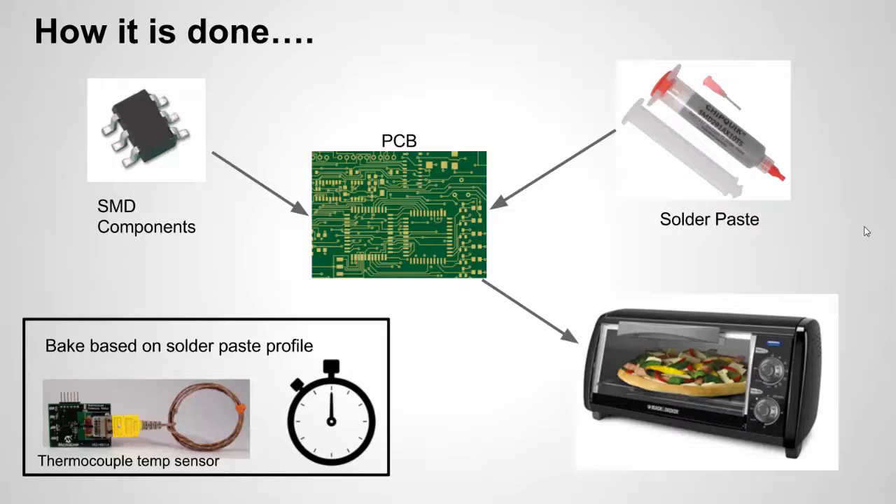There's going to be a profile we need for the heating. They make reflow ovens — you can buy one, but I think they're around $1,000. You can also use a toaster oven. I have that exact same toaster oven in the picture — it was like $25. You have to heat it based on the solder paste profile, and make sure you're not going above the heat limits of your components listed on the data sheet. Don't use the temperature settings on the toaster oven because they're way off — use a temperature sensor.